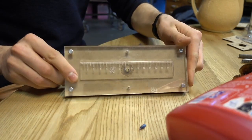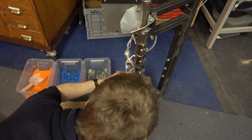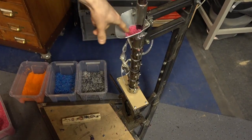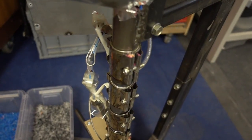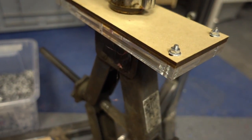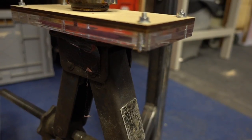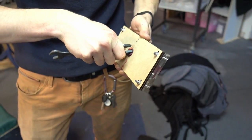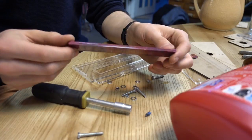Now we're ready to inject our plastic. We use a car jack to make sure that our mold is fixed in the right position underneath the nozzle. The plastic you can see here was collected, sorted, and shredded through our own little plastic workspace. The injection machine melts the plastic pellets with heating elements and pushes the mixture into our mold. Through the Plexiglas you can actually see the plastic spreading and stop pushing the lever at the right moment. After injection, we recommend pressing cold metal against the orifice to prevent the plastic from welling. Now you can remove your mold and get a nice fully recycled plastic product.